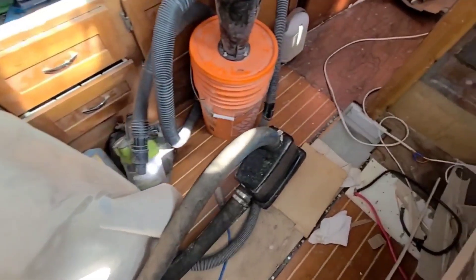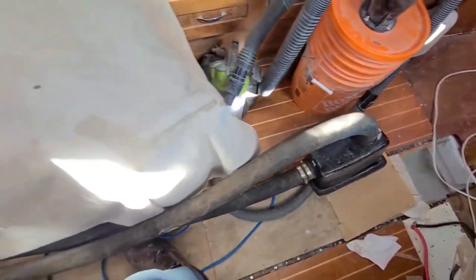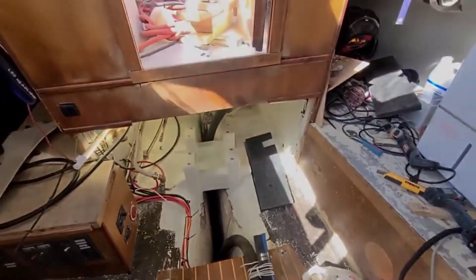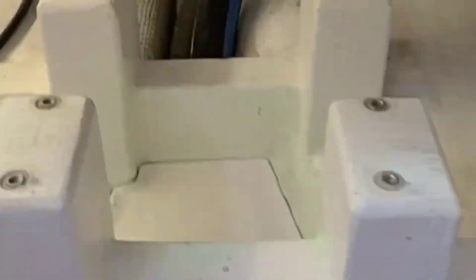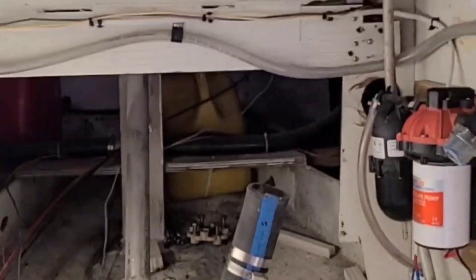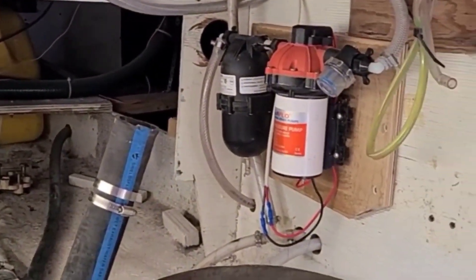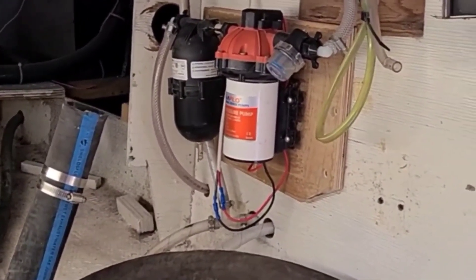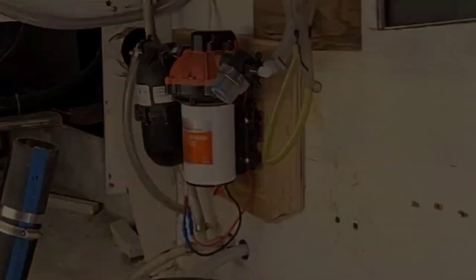It is in the process of installing the exhaust hose with the silencer — it's tough to put on. The hard job is finished, the silencer is inside and exhaust pipes are out. The only thing is that the outboard water pump is not really in place, so I have to move it around, otherwise I won't be able to pass the hose through.